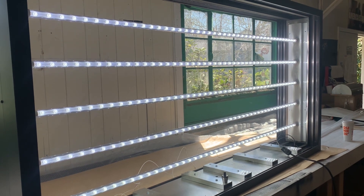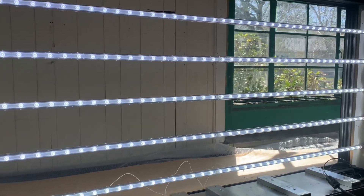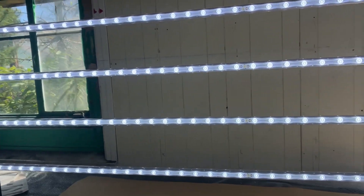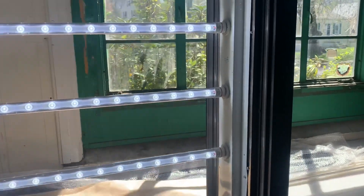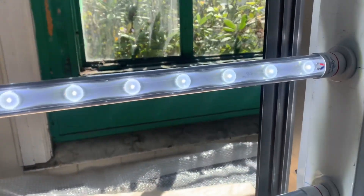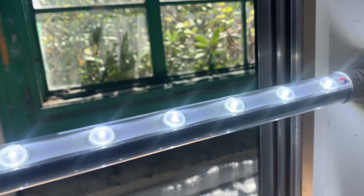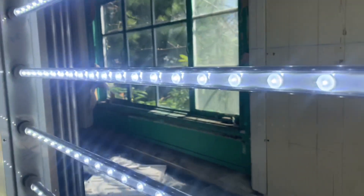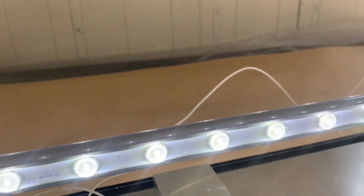Full disclosure — this was my first time using these LED light tubes. These are 6500K LEDs with built-in power drivers. I'm using the same tombstones, and these rotate 360 degrees, so you can direct the LEDs any way you need. It doesn't matter which way your tombstones are oriented — these will line up because you can rotate them. Very similar options are available for anything at home with a fluorescent in it.